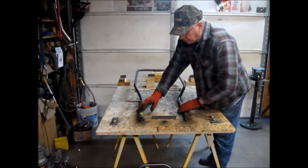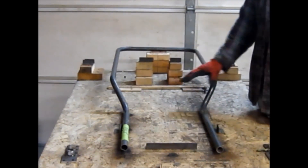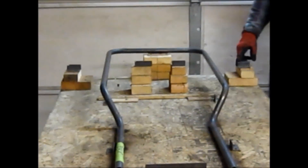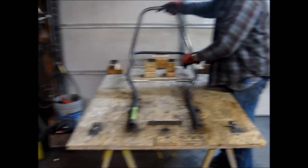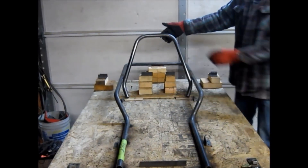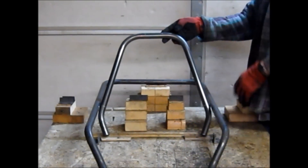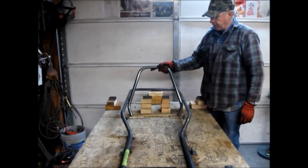This frame — the rails haven't been tweaked the last little bit yet, but we're really, really close to exactly the way it came out of the bender. As you can see, I have a place here for my front axle to bolt to. The rear axle's going to lay in here. I'll grab a seat tube — seat tubes can actually end up getting put in right here. We use an angle finder; I have a mount that holds it in position. Just an inexpensive dial angle finder — I don't use digital because the batteries are always dead. When we get the front end all tied in, we can weld all these pieces in place.